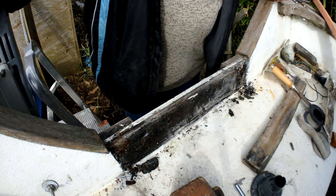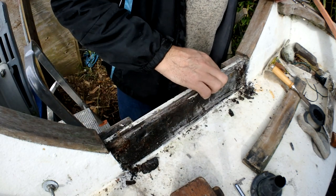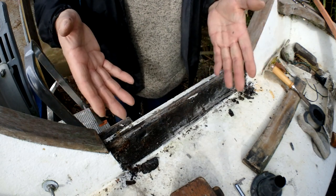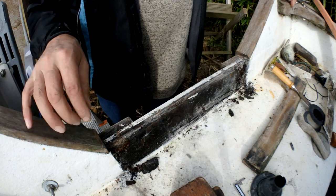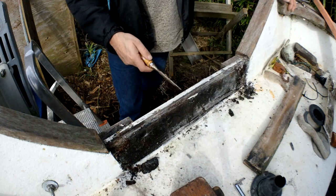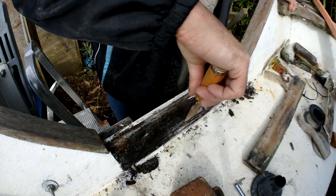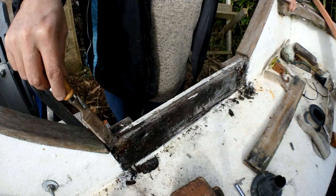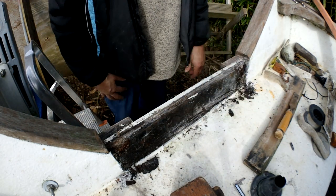This isn't too bad - it's still really strong. But I want to get it done now before the rot goes too far. I've cut it out, and what I'll also do is get the resin wood hardener and soak it into the actual ply all the way along into the piece below, so that hardens it up and protects it from moisture.